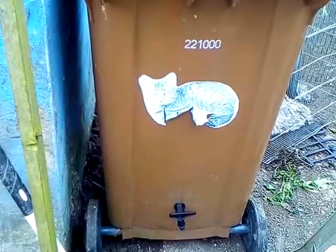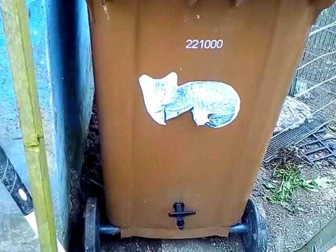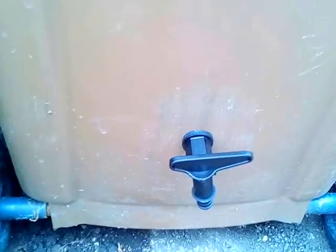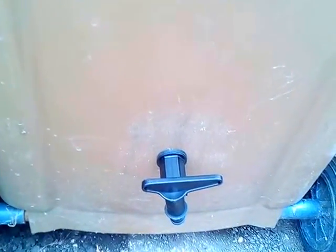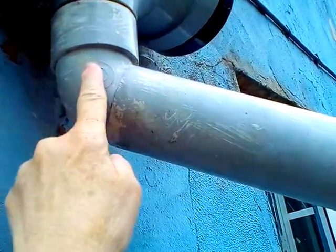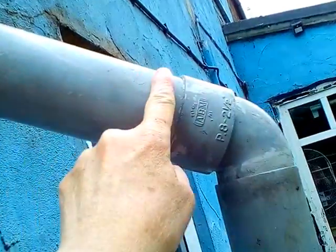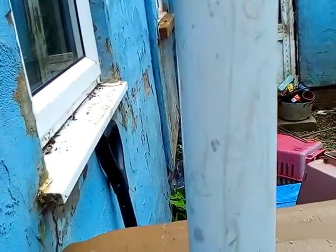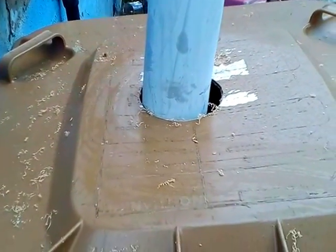So they didn't want the bins back, and that's been hanging around now for a couple of years. I'm thinking, what can I do with it? So I fitted one of my taps — there, look. And I fitted it this side, so that when there's very little water, if I need some, I can still tip the barrel back and get some water. The guttering I already had, but somebody gave me a load of little downpipe stuff. So I just attached this elbow, cut a section to length, cut a hole in the lid, and hey presto.